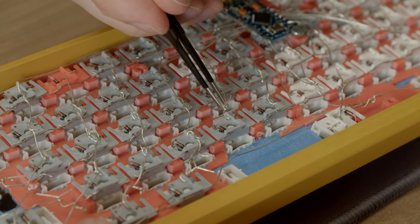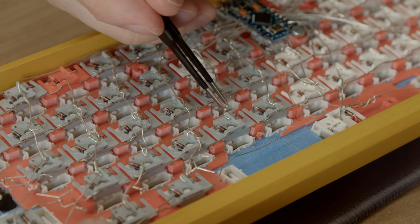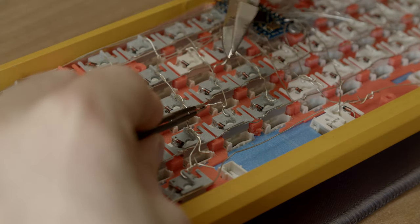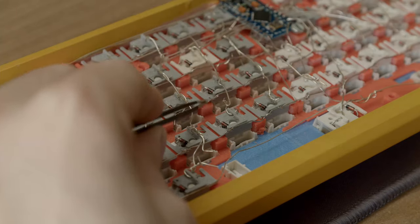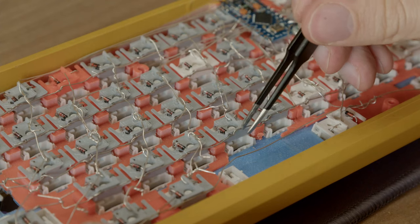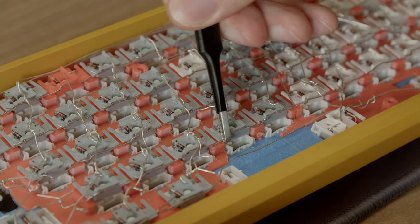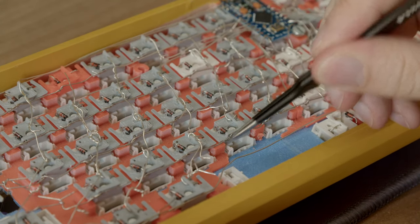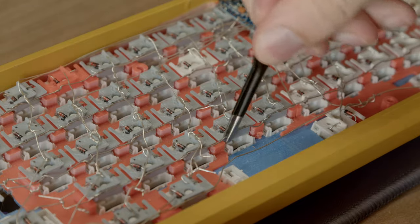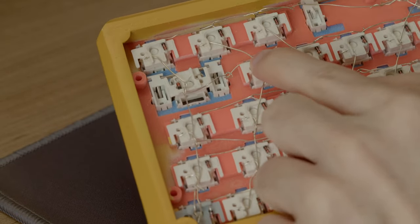Now comes the fun part: printing the hot swap sockets and wiring up the entire switch plate. Each switch gets its own hot swap socket, then the rows and columns get connected together. As I'm just using uninsulated silver plated copper wire, I twisted the ends together and, depending on how much space there is, I also bend the diodes from one diode to the next. You really need to make sure that none of the wires touches another wire, which can be some effort in tight spaces around the microcontroller. Interestingly enough, it has held up quite nicely — I've used this board for about a month with no shorts at all. This wiring did take about a week's worth of evenings with fine adjustments on each switch and hot swap socket to make sure everything is connected securely.